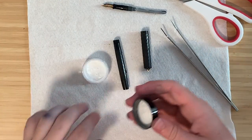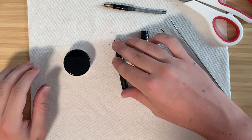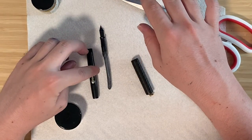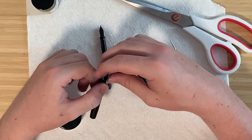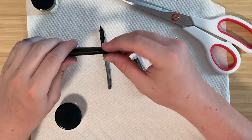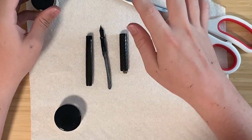I'll put the rest of this stuff away. I don't think I'm going to polish the nib — I think it's perfect as it is. It's fine to leave everything a little aged; this pen's over 100 years old and it's okay if it doesn't look like it just came out of the factory. The shellac won't take too long to set, but you don't want to put it in the barrel before it does. We're going to put some shellac around the other part of the section and stick it in. If you don't want to use shellac and just friction-fit it, that's also fine, but sometimes it can spin around or jostle in the body. So we'll wait for the shellac to dry and then put the section in the body.